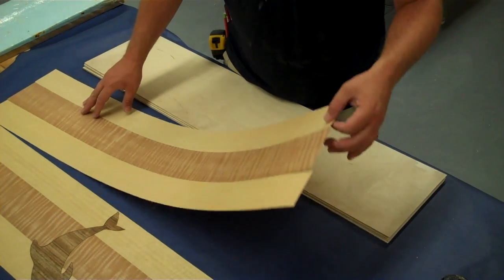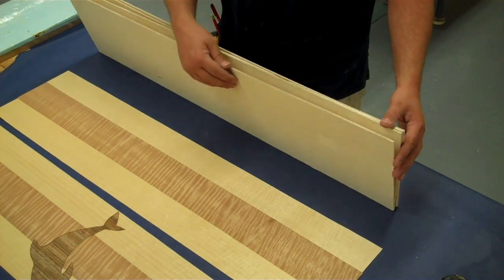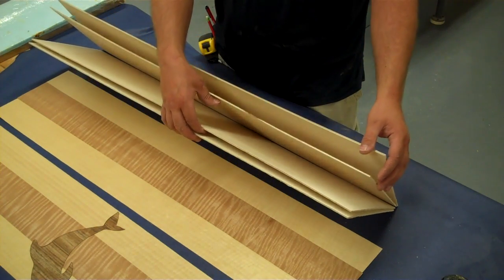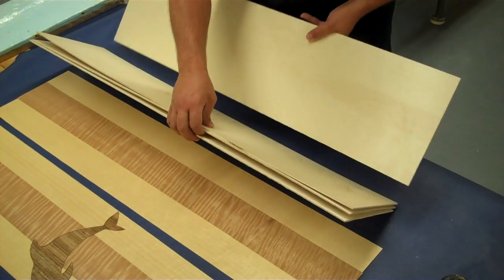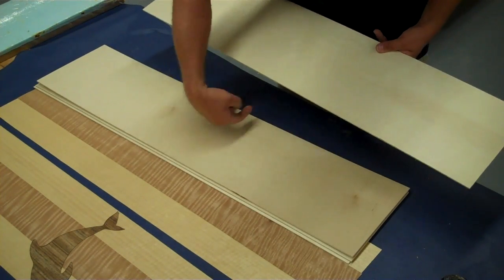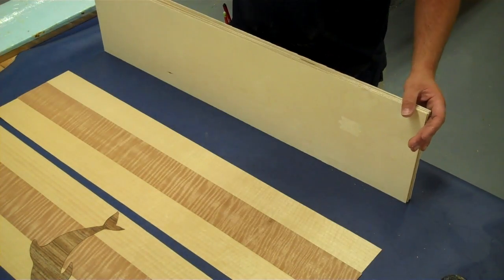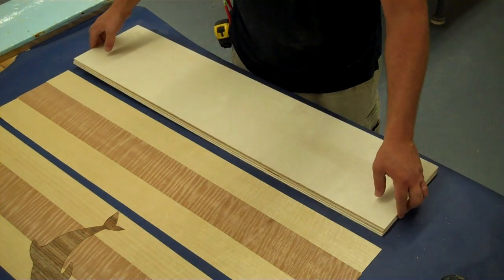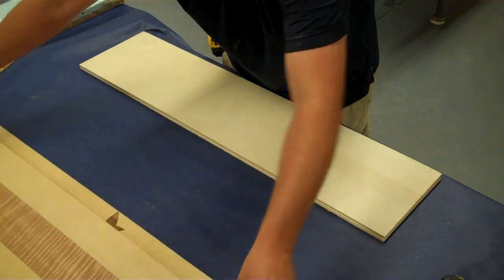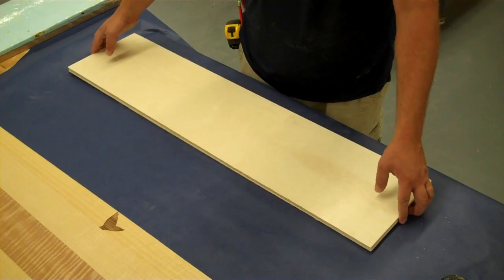If you're doing the veneer, which is what I'm going to show here, you want to have 4 strips of the 1/8 inch Baltic birch plywood that I've pre-cut. I've pre-cut these already to the right sizes. You need 4 of them. You'll notice also the grain direction on some of these alternate. So these grain directions are going straight, where this next one here is going this way. And you want to have that grain alternate as you lay these together. That'll make it a little bit stronger. And so when you're choosing the boards, if you want to choose some that alternate, that's great. Again, work very quickly. And the main problem that we've had with longboard glue-ups is that people are not putting enough glue on, or they're not getting it to the edges.